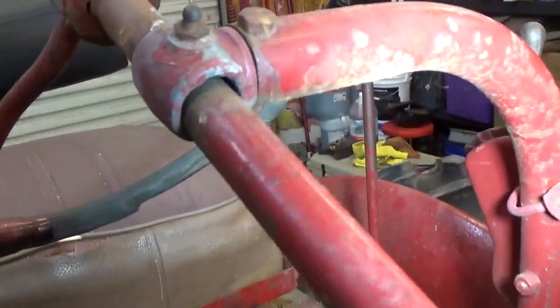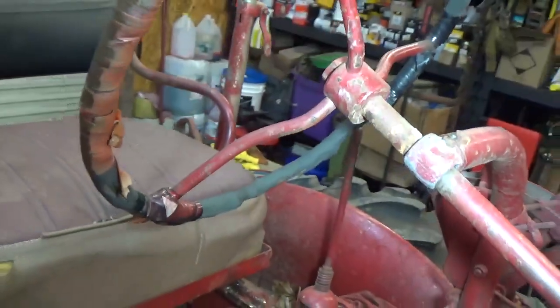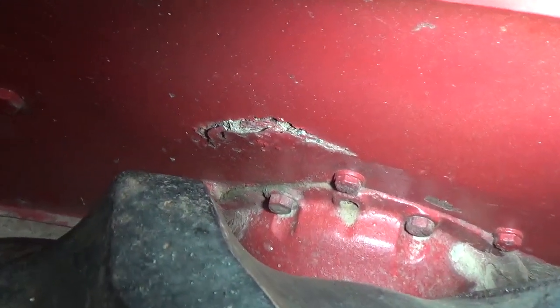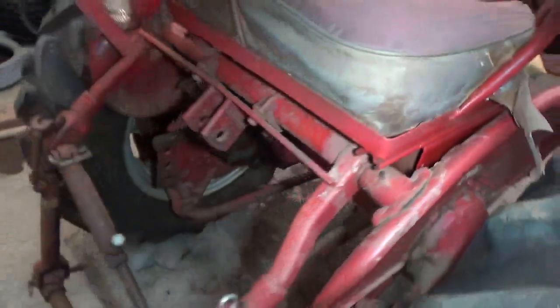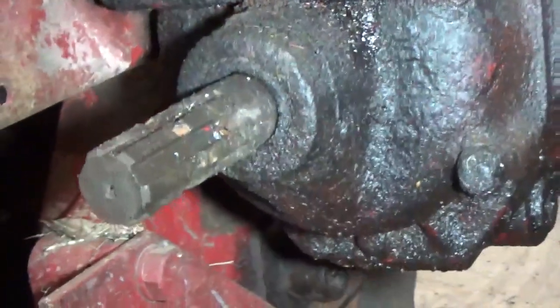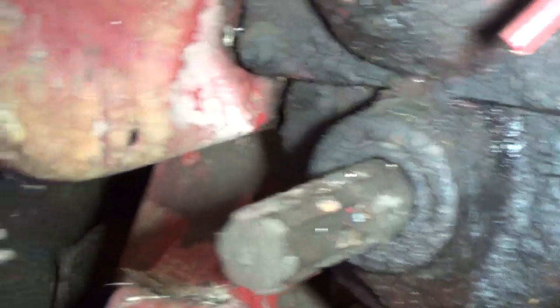Here we're doing an overview of some of the things we've got to go through — these are the most common fixes. On this tractor it's actually in very good shape. The joint right here has a greasable fitting but apparently they didn't grease it, so that's going to have to be replaced. The fenders — we've decided we're just going to replace those. That's a common place for them to split, and we could patch them, but for the cost of labor, welding, and all that, we could just replace the fenders since we're painting it anyway.